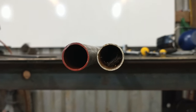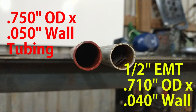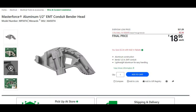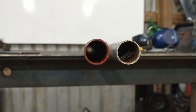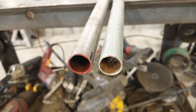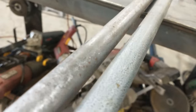The material I've chosen for this project is some 3/4 inch diameter by 050 wall tubing. It's pretty close in size to half inch EMT conduit, but the conduit only measures about 710 in diameter and 40 thousandths wall thickness. Unfortunately that means a standard cheap conduit bender won't fit the 3/4 inch tubing. Aside from the thinner wall, the conduit has a galvanized coating which burns off into a nasty gas when welded and makes it difficult to paint. The mild steel tubing on the other hand welds and paints really nicely.